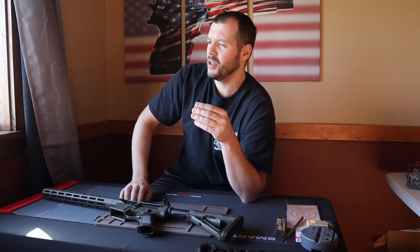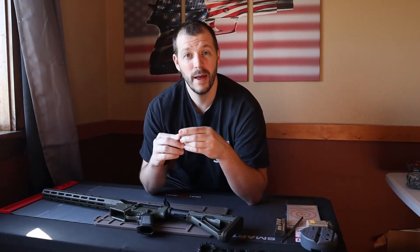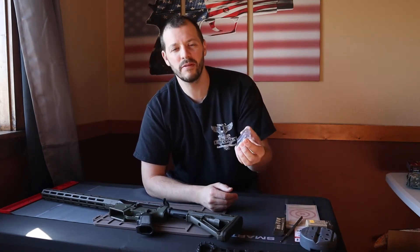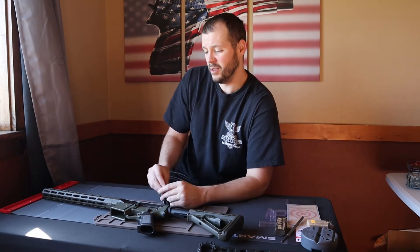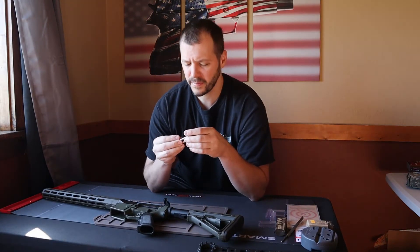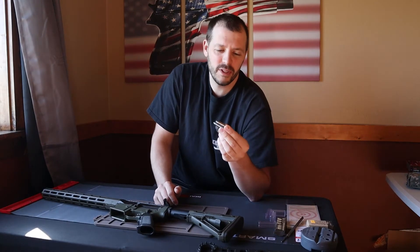We'd also check barrel gauges — there are all kinds of gauges. I've done this thousands of times, so I kind of don't have a choice — I have the gauges and I always do it now. That being said, I know guys who have built plenty of rifles, never gauged them once, and have never had a problem. So I guess it's sort of personal preference. It's definitely recommended to do it at the factory. They should be doing this on new barrels. But this barrel and bolt come from different manufacturers. As long as they're both made to mil spec, you're probably fine. But there are always issues from the factory — maybe something slipped past their QA and you got something bad. So I just always do it.